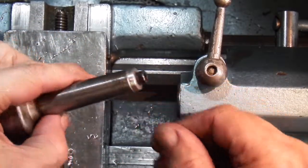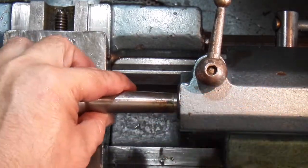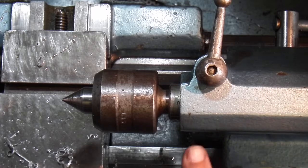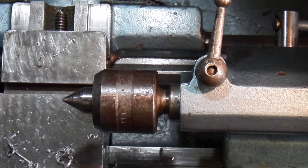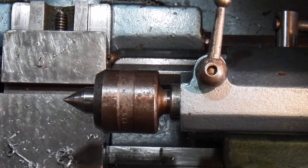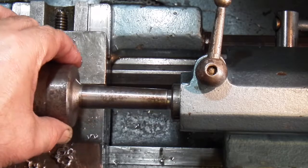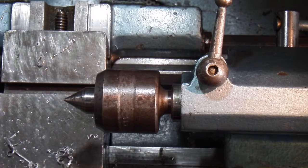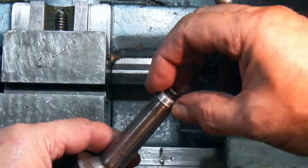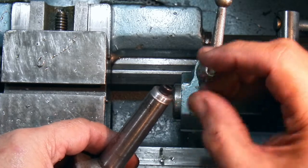What I've done now is put the aluminium bung on the end with a 5mm cap head in there, so now I can adjust that in and out. Before, when I put this in it would lock, and as you came to eject it I'd have to put a piece of wood behind there — that's because the length of the centre was too short. Now when I come to eject it, it touches on that cap head and ejects the centre. I don't need the piece of wood anymore. That's just a small aluminium threaded bung in the hole. Using a cap head, you can extend it with a nut on there until it ejects where you want it to.